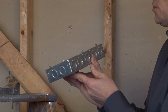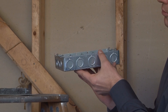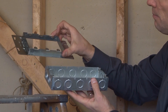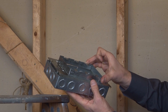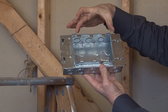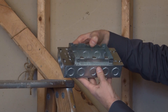You may ask yourself why there are five knockout holes in this box. It's because when you're installing a multi-gang ring, you don't count the two outside knockouts. Here we have a mating three-gang device ring, and as you can see it slides right over the mounting screws, with your three devices in the middle of the box — discounting the two outside, that makes it a three-gang box.